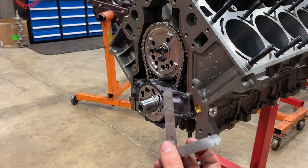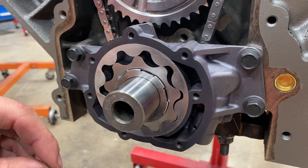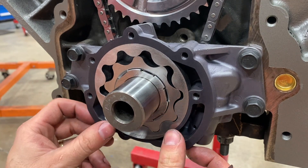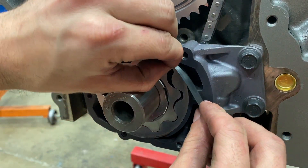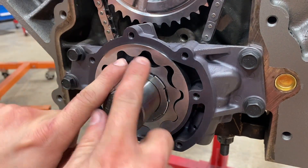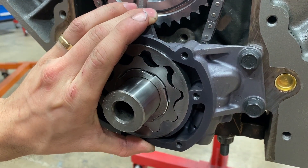What I have found easier is to take two feeler gauges. I take two gauges and slide one of them this way into the pump, press it all the way in directly on the bottom of the gear, then take my second gauge and slide it into the top of the pump and press it into the gear just like that. Because these feeler gauges are long enough, they somewhat wrap around the gear, perfectly centering it in the pump housing — and there's almost no play now.